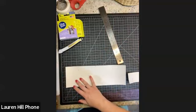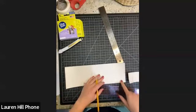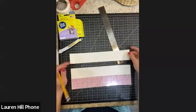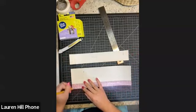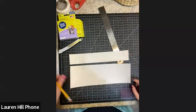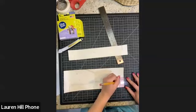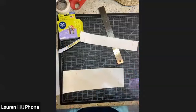We've now started to have places where we're going to point up and down, but we can't cut below this line. We've got the points here, so now we're going to add our notches. We want these notches to connect to each other — one on this side, one on that side. We're going to do the same thing: make a little one-by-one notch. One inch up, one inch away from each side. Two inches up, one inch over — it's the same thing. And we're going to cut that notch here.